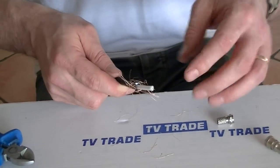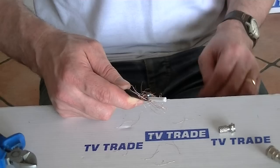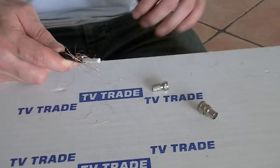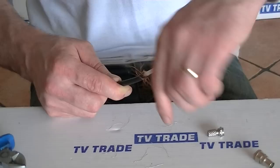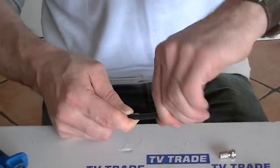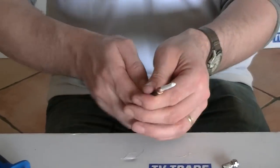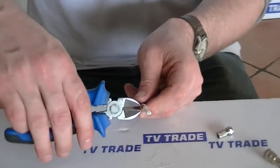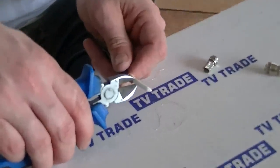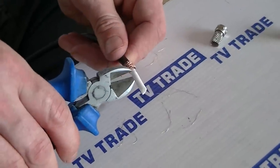What I'll do then is, if we're going to be using this for putting on an F connector or coaxial connector — which we see here beside me — I'll wrap this in a clockwise manner around the actual black part of the outer braiding. Then I need to come down around six or seven millimetres along the braiding here, or around the dielectric, and make a series of cuts through it again.